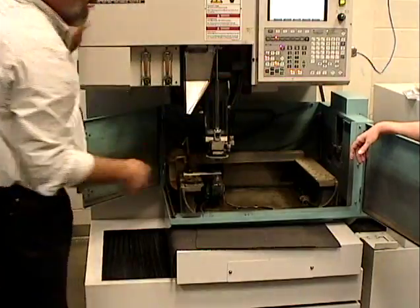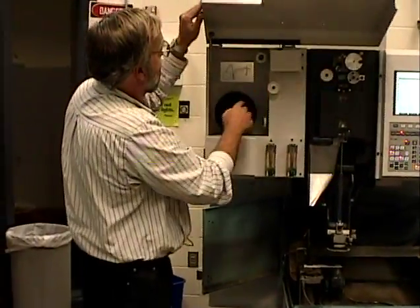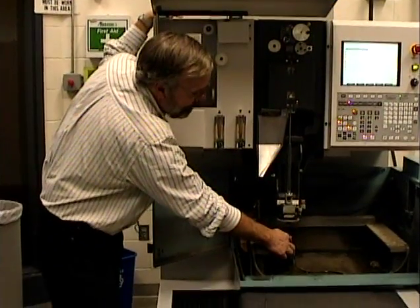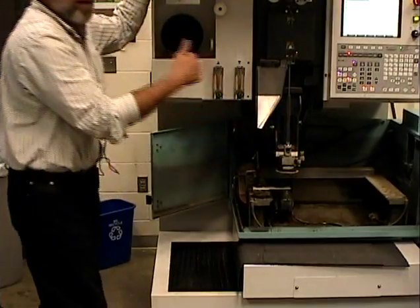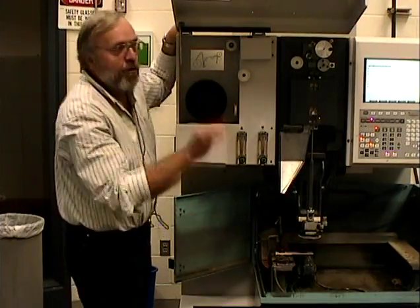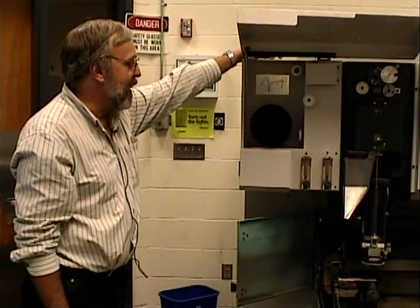The reason the water is running while you're threading it is the wire gets pushed from up here and shoved the whole way down through here to this nozzle, back through this one, and the next roller's in the back. So it sprays water from this nozzle to that one to guide the wire through there and keep them lined up. That's what the purpose of the water is doing.